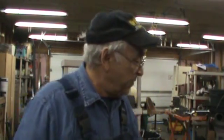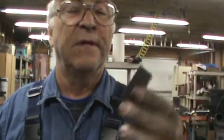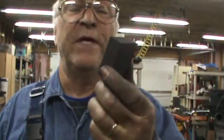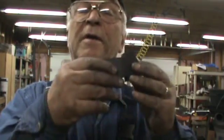So I kept kicking an idea around, and the other day I built a new clamp system. It's really nothing more than a graphite block that I've machined out, cut with a five-degree taper, so the very bottom is just slightly bigger than the two mold halves when they're put together. What you get is the graphite expands less than steel — the steel expands more — so a steel clamp would get loose. With this, both pieces are the same material.